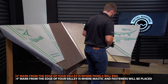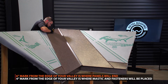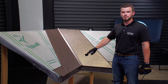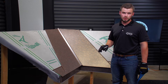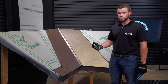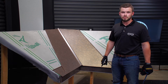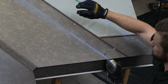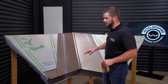An M for mastic. Now that we have everything marked out top and bottom, we're going to snap two lines with a chalk line. Make sure you're not using a permanent chalk line — blue chalk is typically not permanent, but check the bottle before snapping lines on the metal. Now that both lines are chalked, we're going to run our mastic up both sides and then start paneling all the way across.